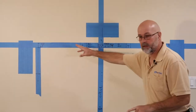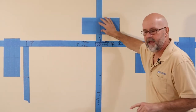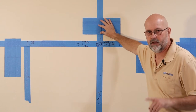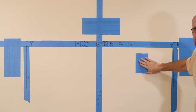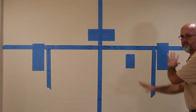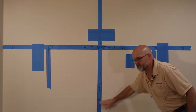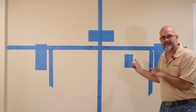Give me just one second, let me get this big boy out of the way, and through the magic of video editing, I'll be back with you in just a second. So when I left this with you before, you may remember the tape going up and down, side to side. We marked all the stud locations out on here. I had kind of a rough cut out of where the center speaker is gonna go. I did not have the side speakers here and I did not have my pass-through box here. We'll talk more about this box in a second, but this gives a better representation of where everything's gonna go on the wall. Remember we had all these extra studs here so we couldn't go down any lower. So we'll come back to this in just a minute.